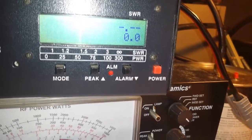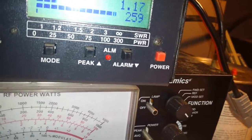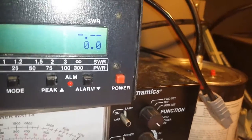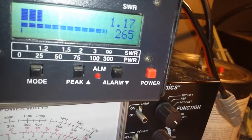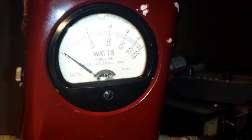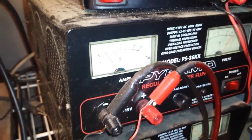About a 15 watt dead key — it's beautiful, man. You can bump that dead key a little higher if you want a higher dead key from your radio. About 259 to 260 watts — phenomenal out of two 455s. On 15 volts, that's 260 watts — phenomenal for two MRF 455s just hitting it with a little bit of watts, with good amplified swing.